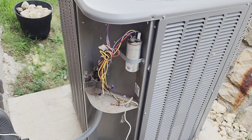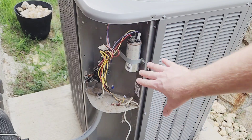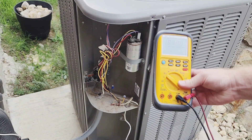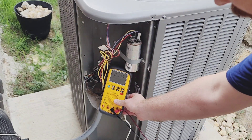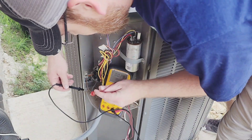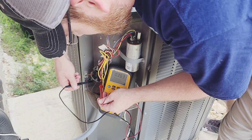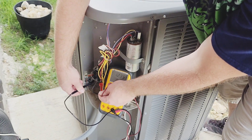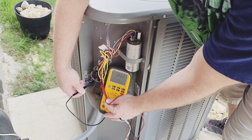There's the capacitor. Before we go touch anything, make sure that the source voltage is completely gone. I'm going to use my meter to test it — got it on volts AC, checking the hot side coming into it — and there's nothing.